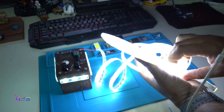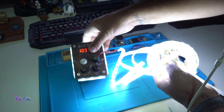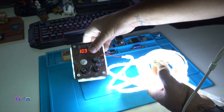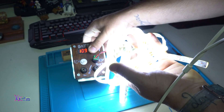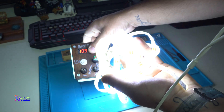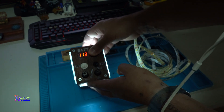Turning off the strip — this is nice. Let's check the voltage: 10.9 volts. The voltage has dropped because we have many LEDs pulling a lot of current. Turning it off, it's showing 11.3 volts.